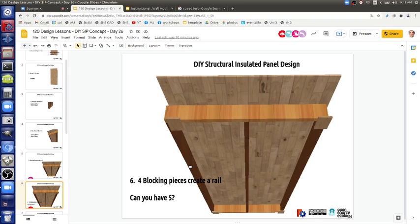Like you could never kind of tell it from design point unless you've had experience. But yesterday, just doing it, we saw that the middle was off by half an inch, which we addressed by putting a block on the outside to suck it in. So if you had a block here, you're constrained to align perfectly in the middle. So let's add one. Which direction was it bowing? Like what was it outwards? Okay. I actually would out, like so to, two panels like this. Yeah. Like that. I think it was because you're not constrained in the middle. Okay. So the panels, the tops were perfectly aligned, bottom was perfectly aligned. But the panels were bowed. Or like somehow in the middle, yeah. Okay. I mean wood is gonna bow all kinds of ways. So the panel was like this. Yeah. One or the other. It was curved by half an inch. And you can't really see that.